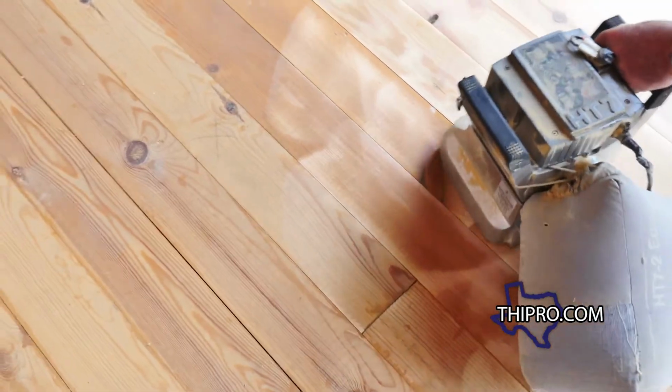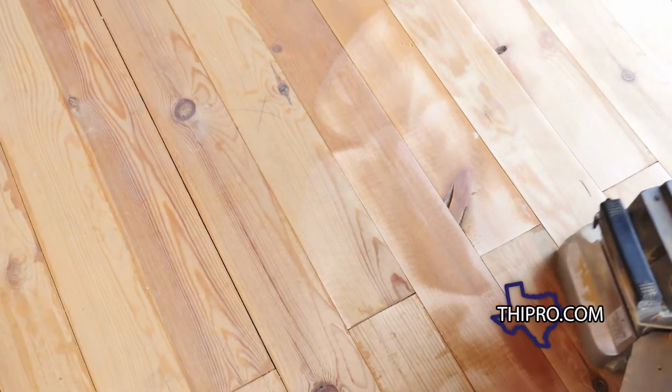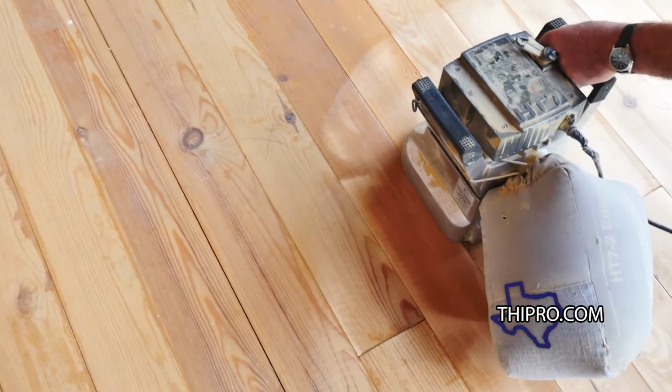So what do you need to do if it doesn't lay all the way back down? Well, now you're getting into some real work, and it again depends on the floor. In general, if it's a true wood floor, not a laminate, not an engineered wood floor, sand it down and refinish it. The sanding takes all the high spots out, and then you just put a new finish on it and you're done. If it is an engineered wood floor and it's buckled, if you can get it to lay down enough, a lot of those can be sanded a little bit as well.